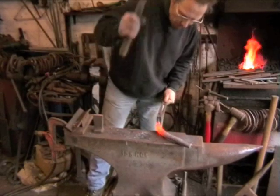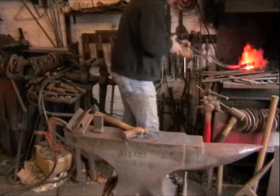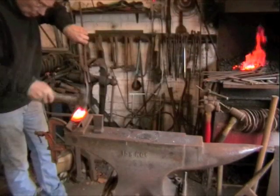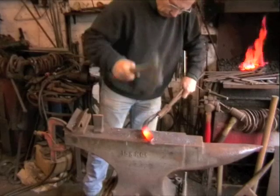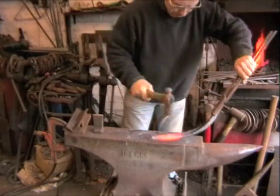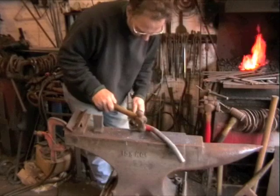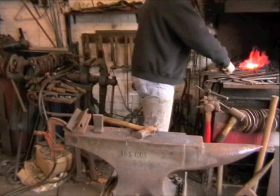It curls up into a bit of a banana. Make sure you are working your hammer on both sides quite evenly, because what I want to aim to do is get the seam running evenly down the middle, which will be the underneath of the snake. Let's bring it in from both sides. It looks a bit erratic — that is a bit erratic. It's tough stuff, this raw material — pretty high carbon steel and it's very tough to work with.